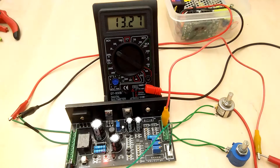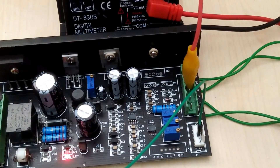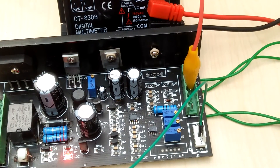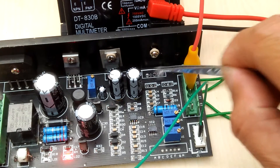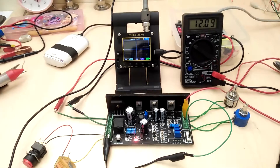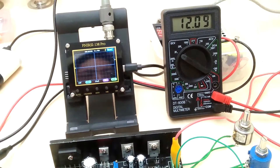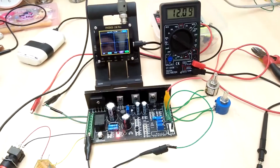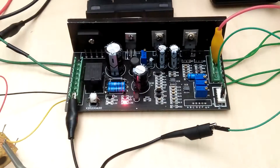But in order to test the closed-loop negative feedback of the current limit function, I need the oscillator working. I removed the transistors of the oscillator — I actually found one of them defective. I will also be checking all the passive components of the oscillator and I am confident I'll be able to bring it back to life. The next functional circuit block I will test is the oscillator. For this test, I will be using an oscilloscope. I also connected a high voltage step-up transformer to the oscillator, because it will only work with an inductor load, as I found out in the LTSpice simulation.